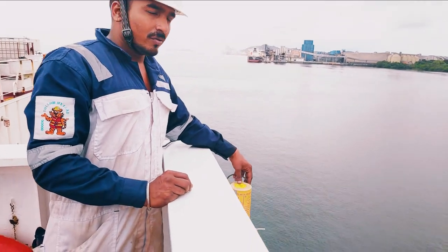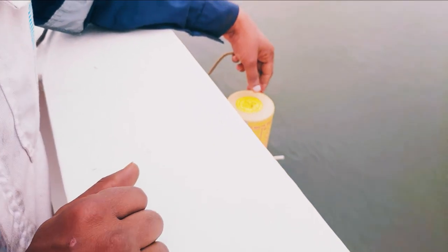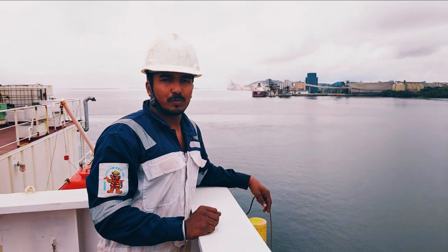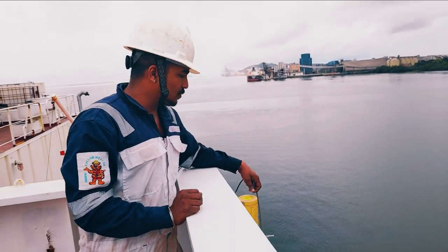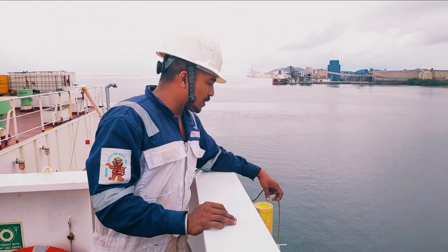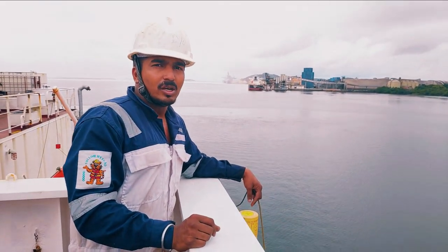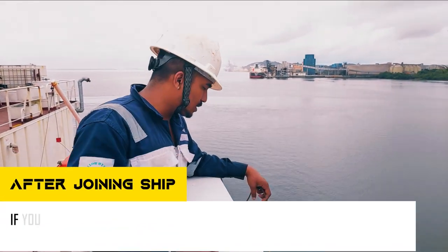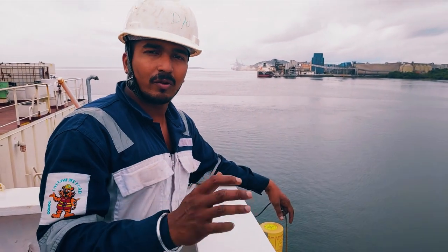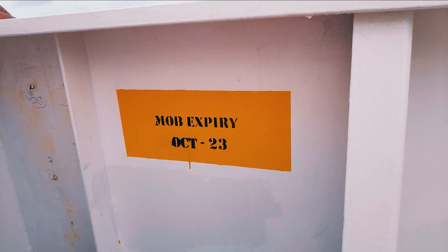The second thing - on the MOB wheel you have to check the expiry date. Most of the time the guys providing the MOB do not include a certificate. For proof that it is not expired, we have only the date printed on it, and it is valid for five years. Because of sunlight and exposure, it gets faded. When you join the ship, first confirm it is in good condition, you can see the expiry date clearly. If it is clear, take a photo, make a color printout, and file it in the ship's certificate file. You can also stencil over it as an easy reference so you know when it is expiring.